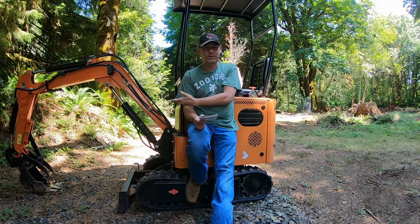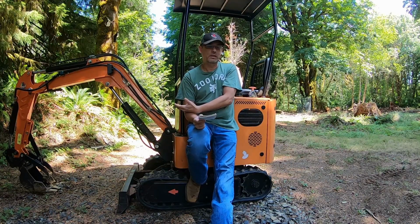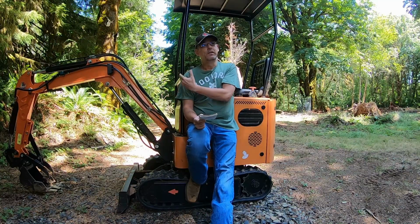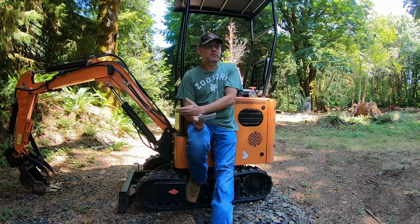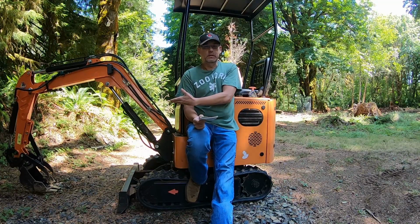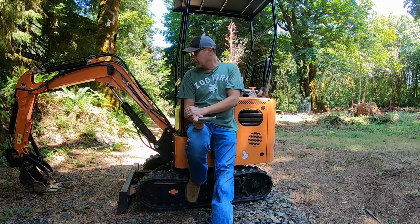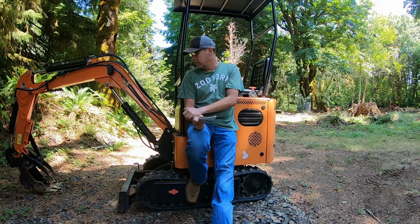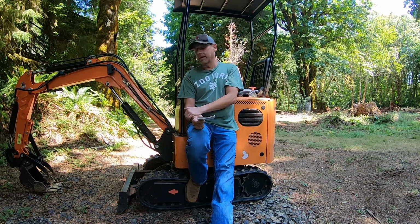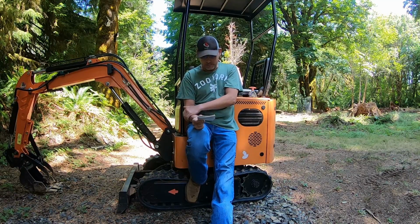Like I said, the claw should not be able to bend by the power of this excavator, because it should be calculated out that I need this thickness of steel to prevent that from happening. So either the steel is not that high of a grade, or the claw is just too thin and should have been made thicker. The only other thing I could think is that it was from a different manufacturer, but then again, at that point, they should have purchased one that is bigger.